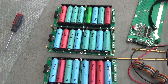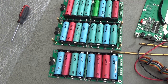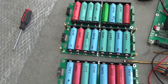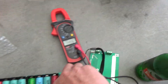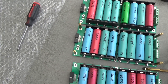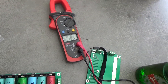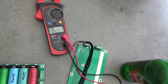Starting off with 94 — carrying on on that logic, what I should then get is fairly balanced parallel packs. What I should also get is a nominal 14.4 or closer to 15 operating volts out of each unit — so that's 14.96 on the second one, 14.93, and 14.95.